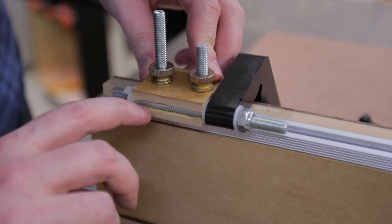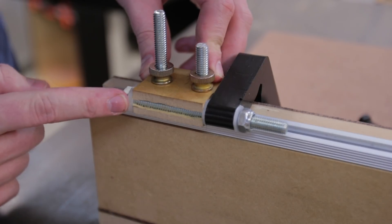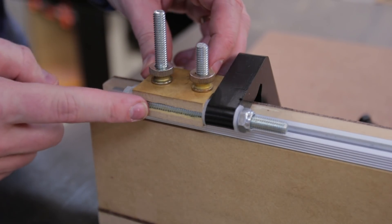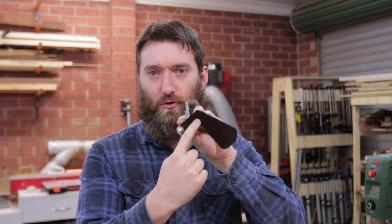That wasn't great drilling — all the MDF burst out the back. It is actually a straight hole, but I wasn't clearing the sawdust quickly enough, so the pressure from that dust caused the drill bit to burst out. The good thing is that tells me I should add more material to the back so it's a little less dicey. So I'm going to do a full prototype test in MDF now, redesign those parts with a little bit more allowance for the bolt hole back, a little less depth of cut for the groove overhang section, and fix up a couple of issues with the arm — namely the space in the corner.